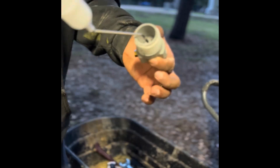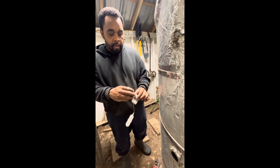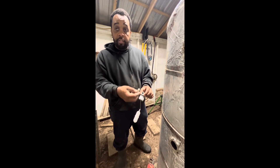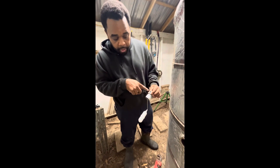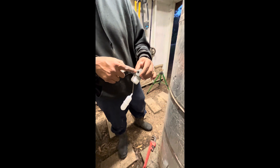What I'm doing now is installing some thread sealer, and I also installed a little bit of Teflon. I'll reinstall the gauge on the part before I screw it all the way back in, because sometimes if you don't install it and you try to do it after, it's going to hit the tank. You also want to make sure your hole is drilled all the way through so that your gauge can read the PSI pressure on the inside of the tank.